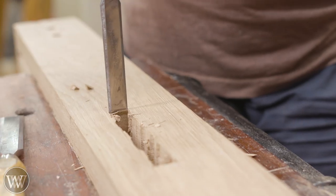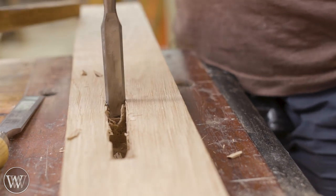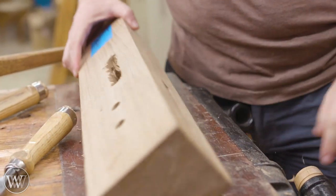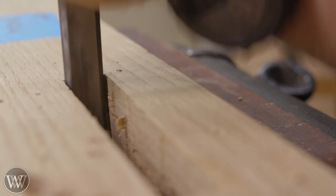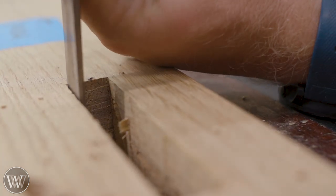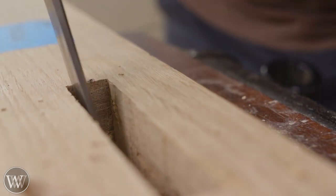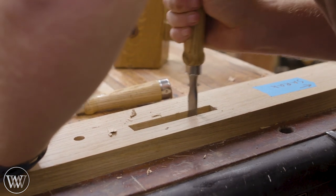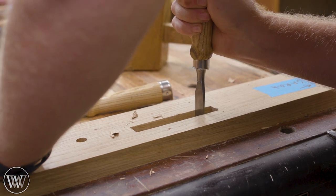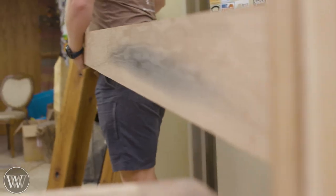Because this is worked from two sides, I'm actually going to do it halfway down from one side, flip the board over, and then do it halfway from the other side. This makes it very easy to get even all the way across. The other thing is that you get a perfect mark on the outside line all the way around, which allows you to open up the inside just a little bit — it doesn't have to be perfectly smooth and flat. Here you can see I'm checking to make sure the edges are flat, or at least that the chisel touches at one side and then at the other, so I know a straight line between the two corners.